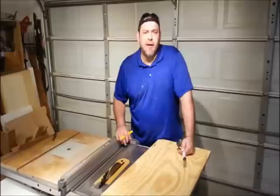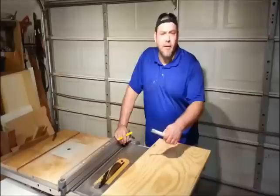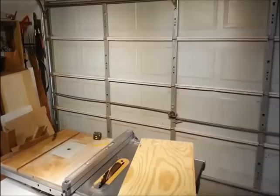So I'm making this jig 6 inches tall. That way I know that I can accommodate my blade size on my table saw. To start with, I want to minus an inch and a half off of that height and cut one strip of plywood for the back of the jig. So I want to cut it at 117 millimeters or 4 and 5 eighths.